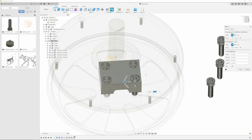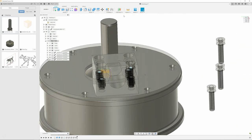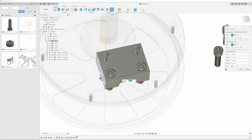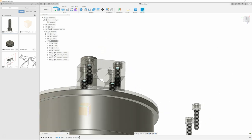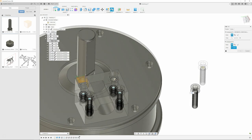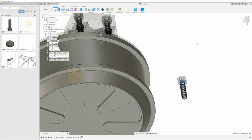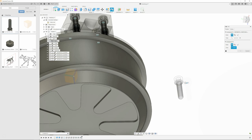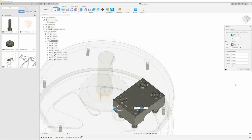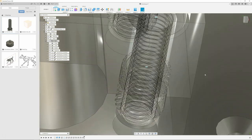That little kit has different materials - they're calibrated with the same weight but look bigger or smaller according to what material they are. That helps me when CADding: I can have that on my desk and know that aluminum is going to weigh this much for this much volume. For anyone who really wants to get hardcore about it, there's something called calibrated dowels - small cylinders of metal precisely cut to a specific diameter. You keep a set in your shop so you can measure holes precisely.